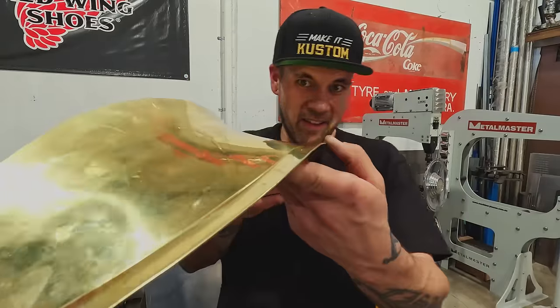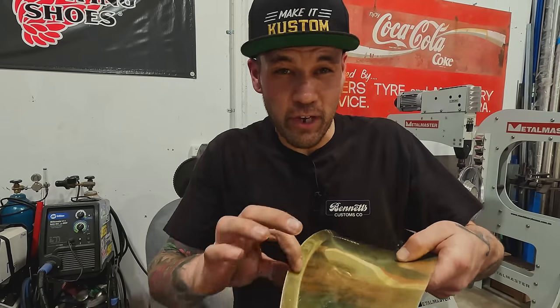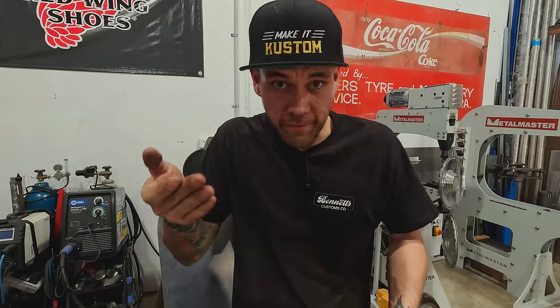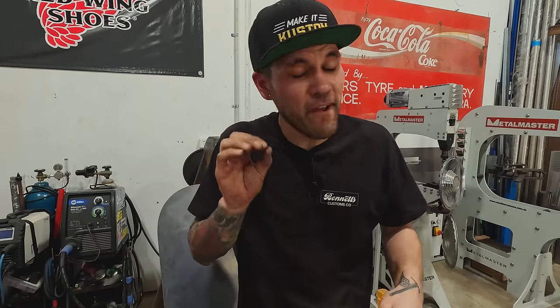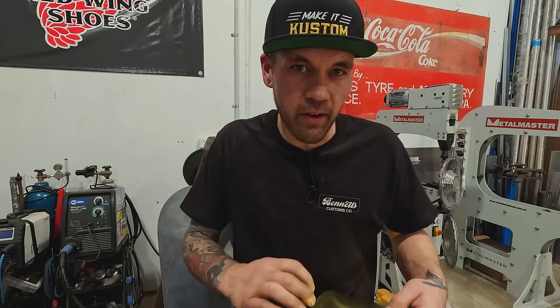It's gonna be a lot of tuning on this edge. As I said, there needs to be a little bit of stretching on this, so we're gonna put the flat anvil on the lower, and it's already flat on the upper, and we're gonna run over this flange very lightly and just be so careful, because I really don't wanna have to shrink this with the kick shrinker and mark the brass.